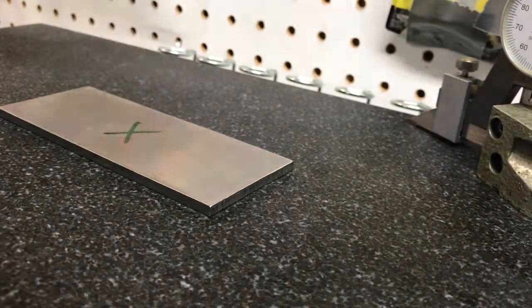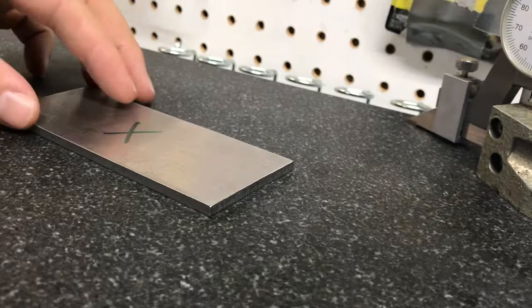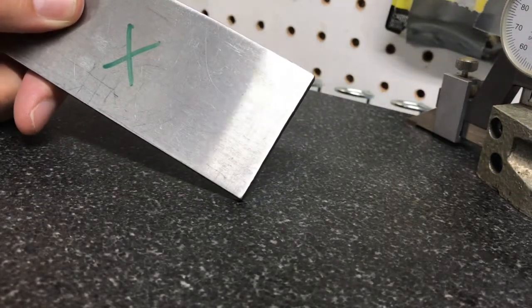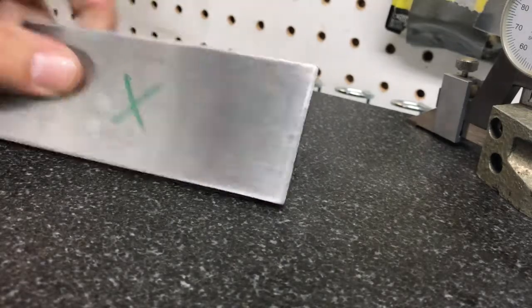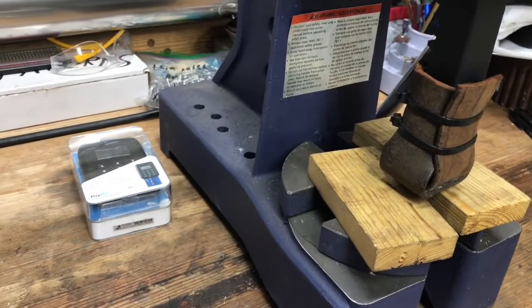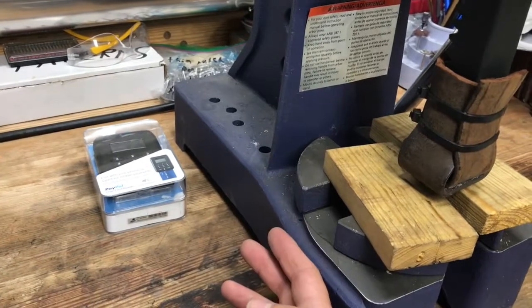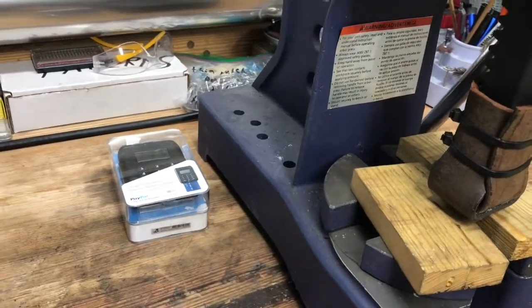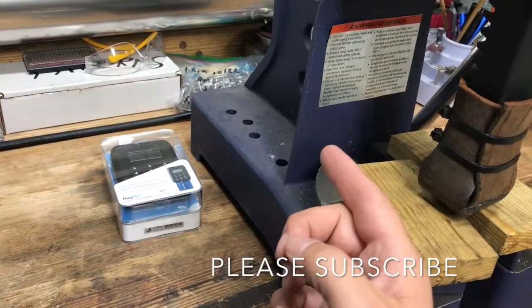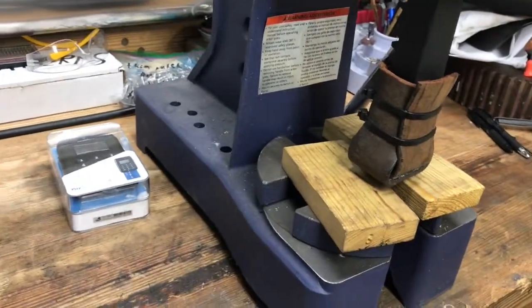This method takes a little bit of time — you have to go back and forth between the arbor press and the surface plate. I have a small shop; they're relatively close, about 20 feet, so I don't mind walking back and forth. But this is a lot faster than spending 15 to 30 minutes surface grinding the bar stock. I hope this helps. Thanks for spending six minutes with me — I greatly appreciate that. Please like the video, and we'll get back to the machining in the near future, possibly some CAD CAM. I'll see you guys in the very next video. Be sure to bolt these things down so they don't flip off your table and crush your foot.